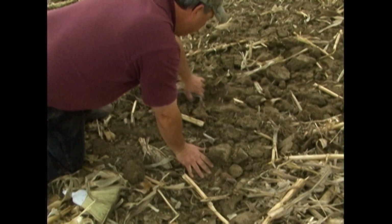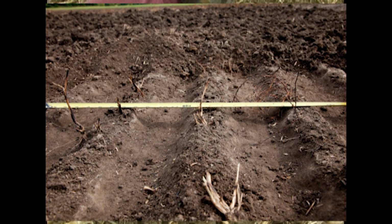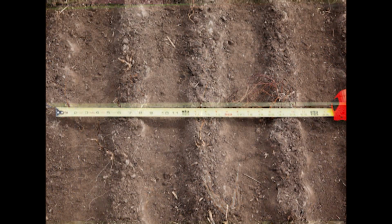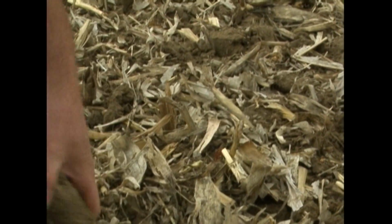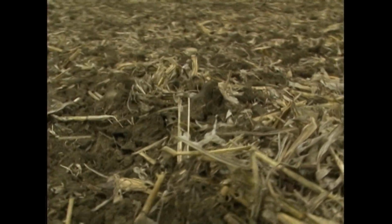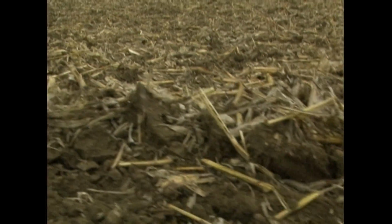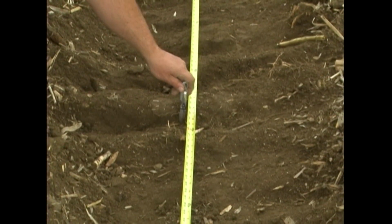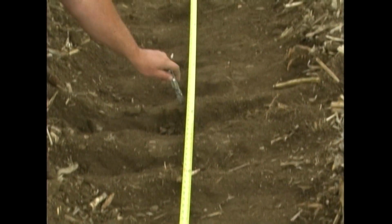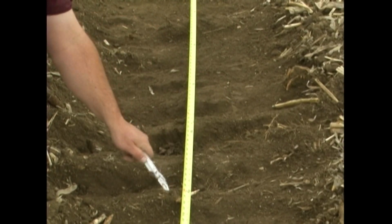As we look at the first competitor, note the severity and depth of the grooves in the soil. It's obvious that this is an angled gang unit. The presence of long compressed chunks are a further indication that this unit is a disc-style tool. Note the unevenness of the soil surface and the ridging at the end of the gang. The largest problem becomes clear as we pull the soil back. An extremely rough subsurface appears that will result in poor seed placement and uneven emergence.